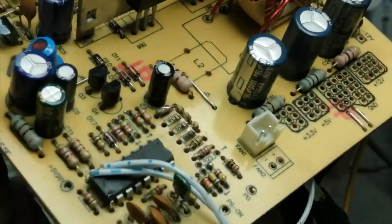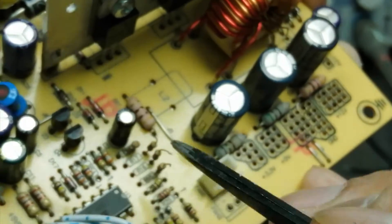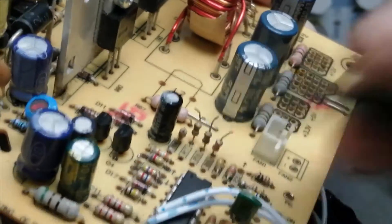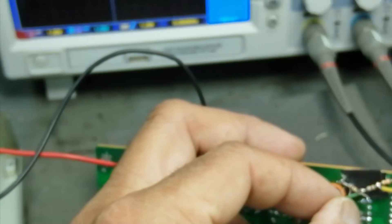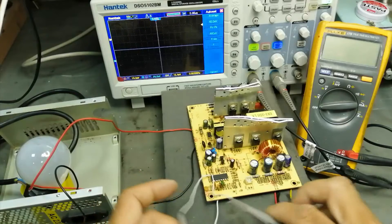Without these sense lines, I removed the resistors connected to pin number one, two, and three. Pin number three — that is 12 volt — and 12 volt are applied for a voltage divider network, so I bypassed everything. I connected this set of three resistors as a voltage divider network. They simulate whether the power supply is working or not. Even if there are problems anywhere, you can troubleshoot using this test jig. I connected both channels here in the first step.